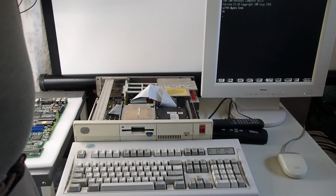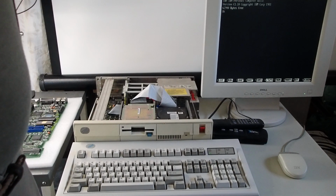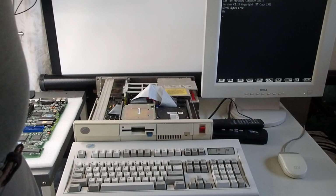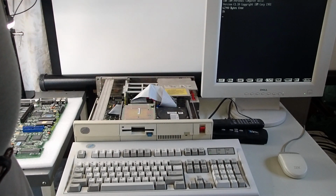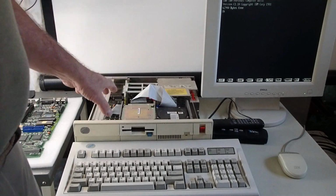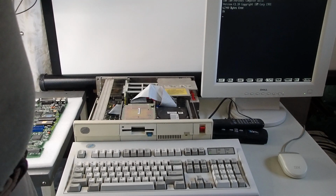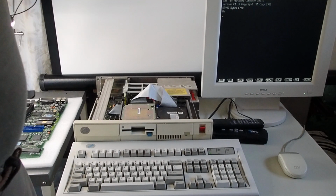And so it was, in fact, another one of the all-in-one units. And that looks like it preceded the Model 25. So it actually may have been a prototype for that unit at some point. And when he opened it up, because he couldn't get it to, it would just give the dual beeps, no display at all. When he opened it up, you could see inside was the Model 30 components, the planar, the riser, the floppy drive. They were just straight off of the Model 30. So it very well looks like IBM put those components in an all-in-one system that could have been that Model 25 prototype for later on.